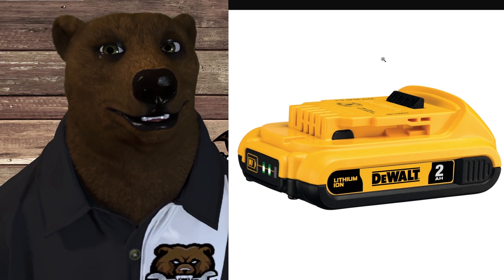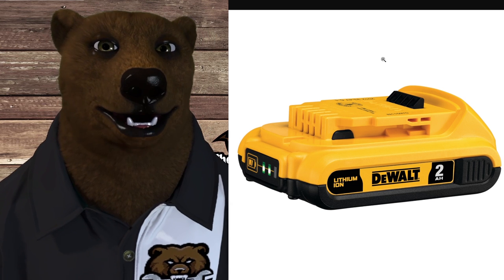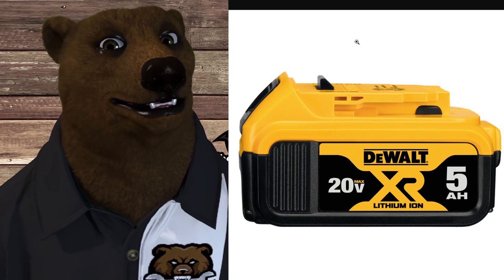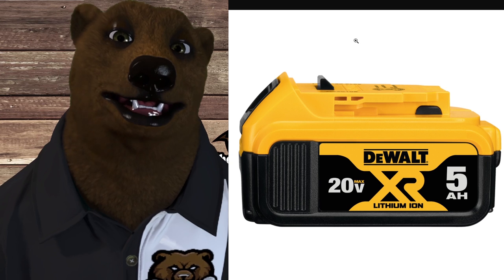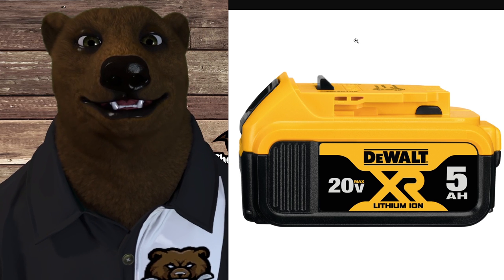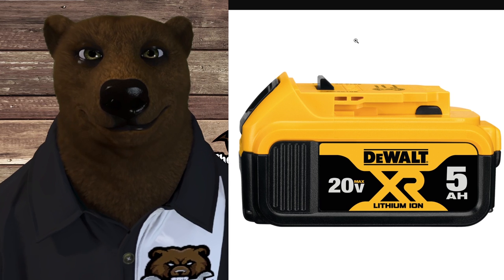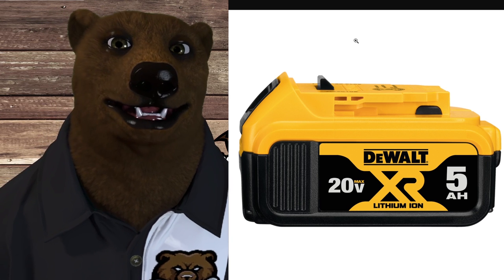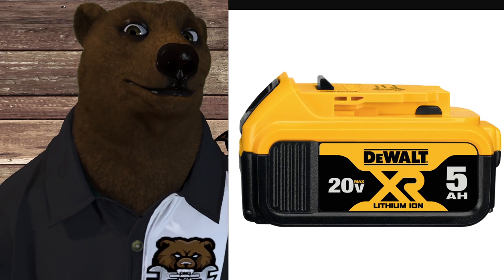You've got the basic 20 volt battery — the one that comes in most combo kits — whether it's a slim-line one with five cells or a five amp-hour. If it just says DeWalt on it, it's your basic 20 volt battery. They do the same thing in the 12 volt as well. Then you have what are called the XR batteries. XR tools are brushless, and XR stands for Extended Runtime — these use premium cells and premium tech. DeWalt claims 33% longer runtime when used with brushless tools. I haven't verified that myself, but they're definitely a better quality battery than the basic DeWalt batteries.